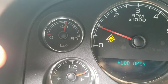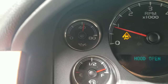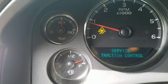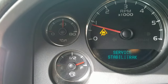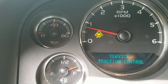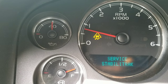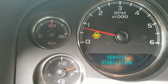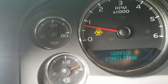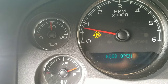It's cold. I just fired it up. It's due for a service — need to build track on that thing. I probably need to reset the computer because it went to zero oil pressure and shut the engine off last time I drove it. It's full of oil, I checked it. I think I have 10W-30 in here. I guess the oil pump could be intermittent. Because if it was a bad oil pump, it seems like it would have zero pressure all the time.